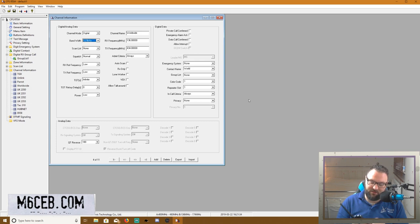On this particular radio, we've got the Kenwood style connector, so I've got the cable plugged in. I did a read from radio there because I've already programmed this. You can fill all this information out and build your code plug, keep saving it, and it'll just be a file on your computer. You can go in as many times as you want, edit it, tweak it, go back, and put it on the radio. Plug it back in, go to write to radio, and keep doing it until it works.